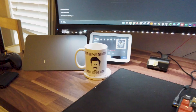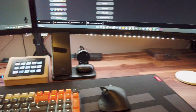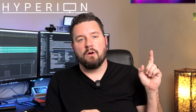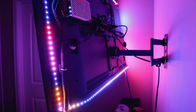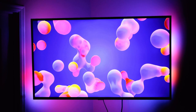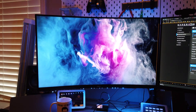I've actually been playing with WLED for quite some time. I used it on my office desk light project — it started as a project to create my own custom down lights under my monitors, but it evolved into a full Ambilight for the desktop computer. One of the coolest things about WLED is you can connect it with the Hyperion app. You can run the Hyperion software on your computer and have it output colors to attached LED strips to match what's on screen.